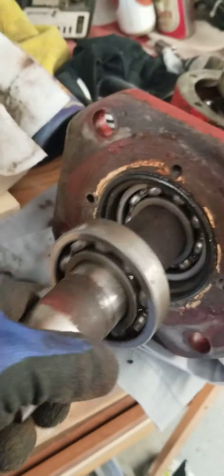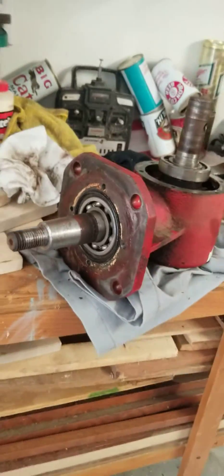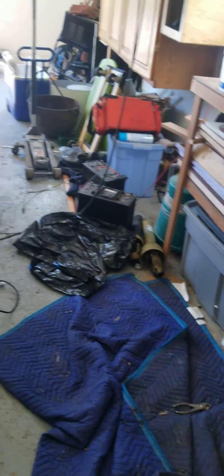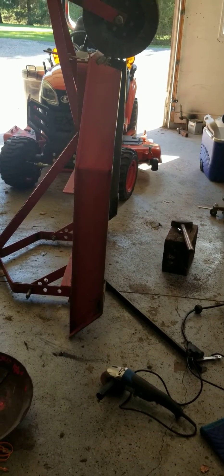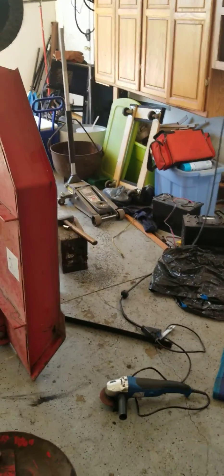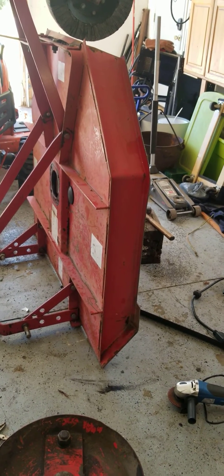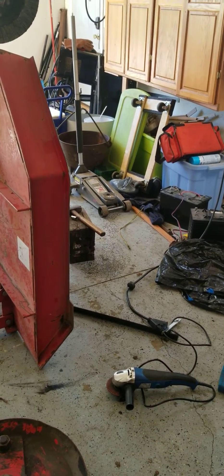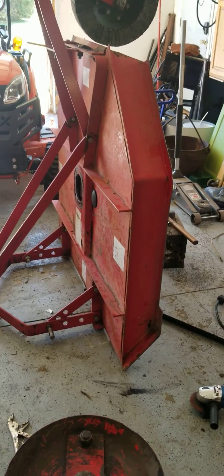So yeah, I had a 48-inch bush hog where the PTO was spinning but the blade was not spinning — it would spin lightly but obviously had no pressure. Hope that helps somebody. There was a key in that gear that sheared — hope it helps someone. Have a great day.